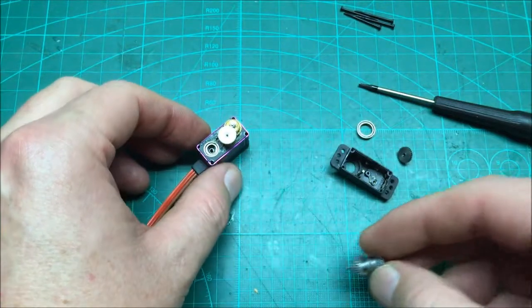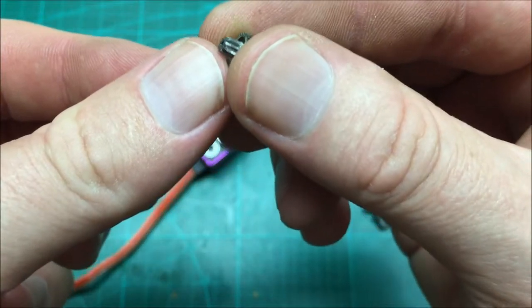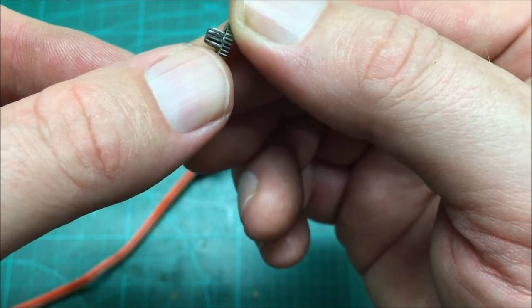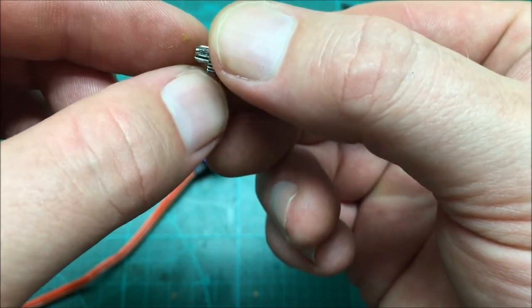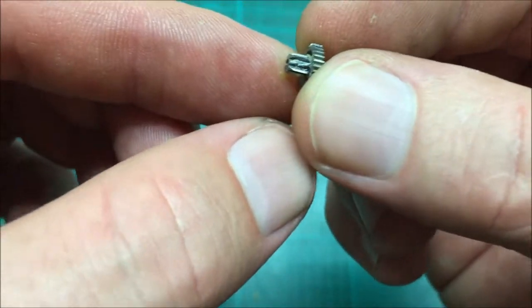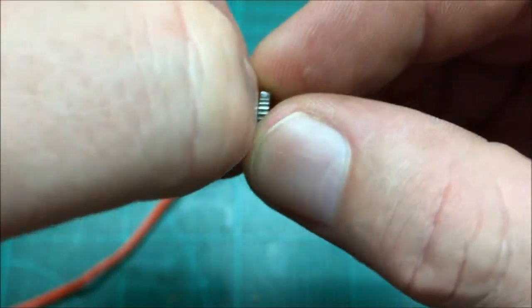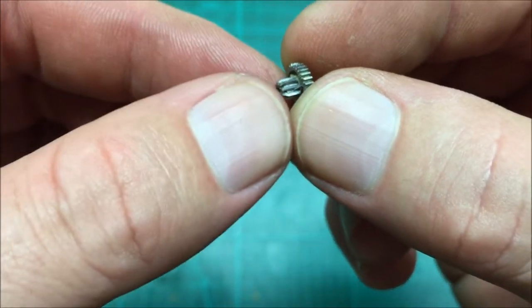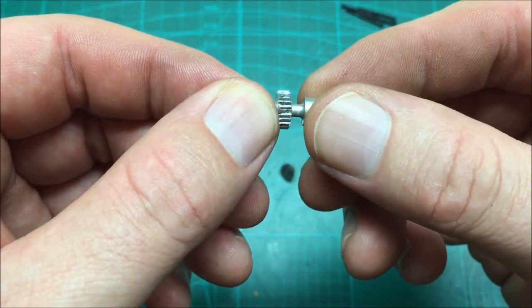If we look at the other gears involved - this is the gear that actually drives the other one. You can see it's got a little bit of damage, but its teeth are actually still pretty well intact. These tend to survive because this gear is actually made of steel, not aluminium. There's a couple of spots to clean up - that looks like aluminium stuck in the gears. We can pop that out, and those teeth are actually in good nick. So the only thing that's actually damaged here is the final output gear.